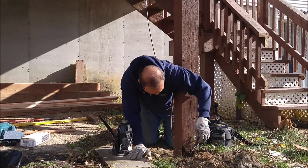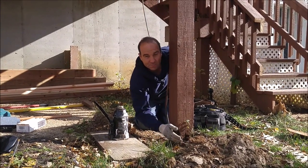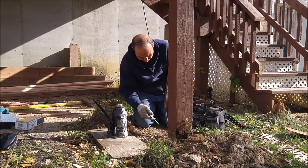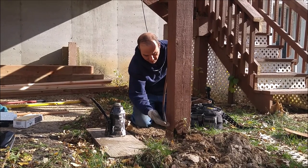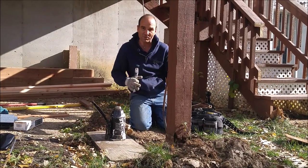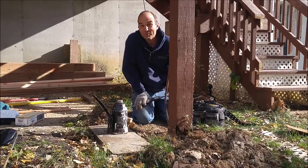Here's what we've got. We've got a rotten post here because all this dirt was piled up against the post and the dirt was rotting out the bottom of the wood. We can see as we dug down here that there's a concrete pier but it's just too low. So what we're going to do is cut this off across here, bring our pier up, and have a new top to our pier so that it's above the ground level. You really don't want the wood post touching the ground even if it's rated for direct burial — it's still going to rot eventually. This metal post base should be separating the concrete from the wood, and the dirt should be below that.